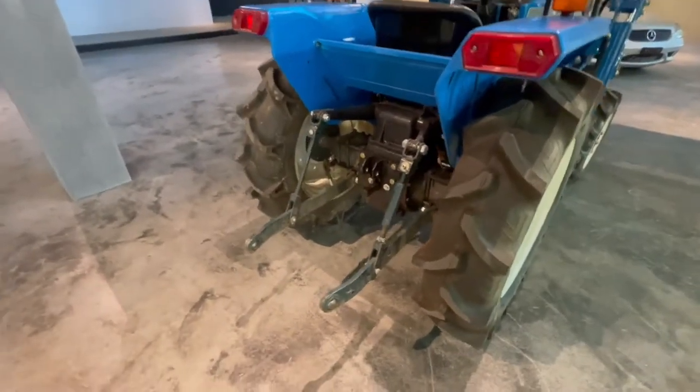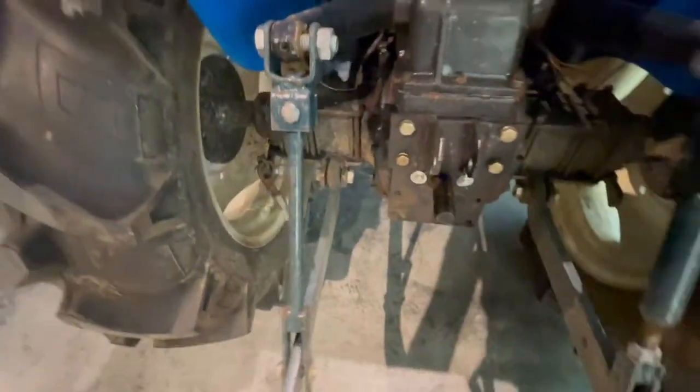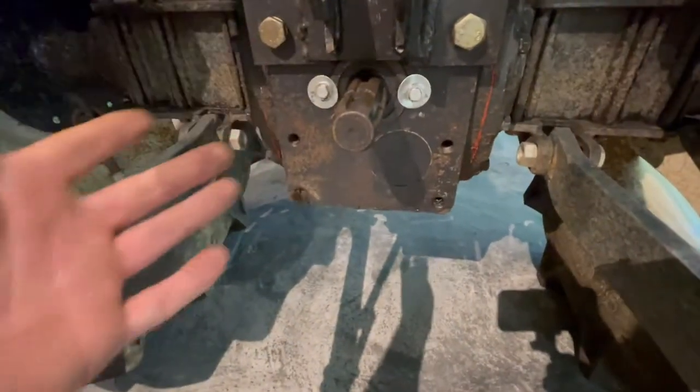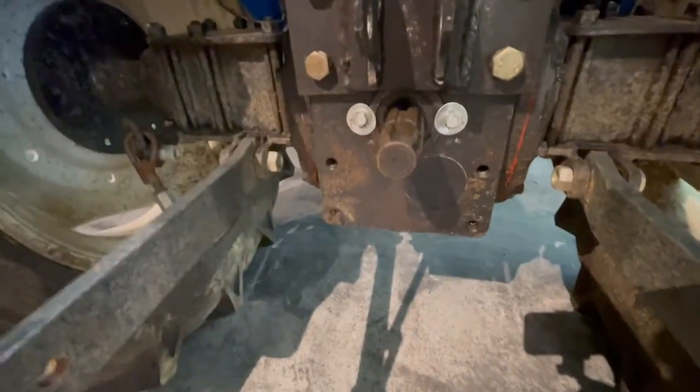The last owner told us about some problems this tractor had. Some parts had been broken off. That's a bit the quality of a rebuild. Also, there was a second problem I know exactly: normally it needs a bracket here that also attaches the seal. Because the bracket was missing, they fixed it differently, so the seal came off and all the oil came out of the tractor. The last owner told me they fixed it the way they did, and it worked for about 40 hours. So it's not the biggest problem anymore.